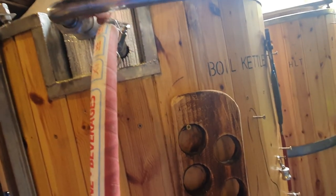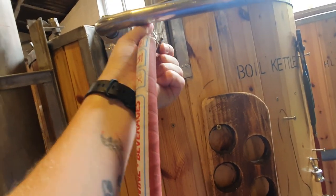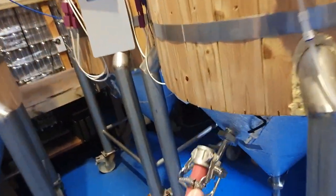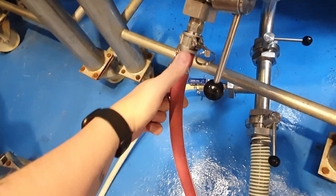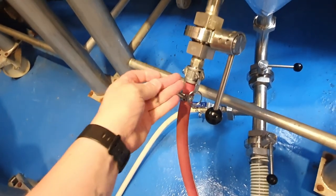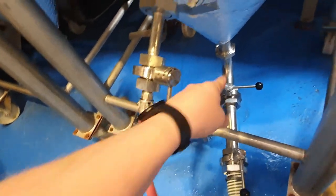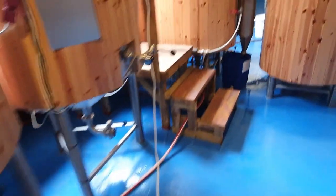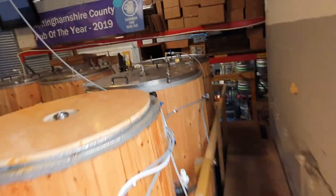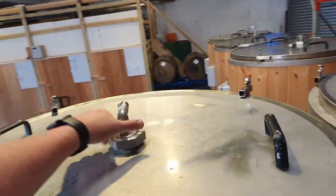Let's come over here and continue with the brew day. I'm going to isolate this supply. Make sure the supply feed in this hose is also isolated — we don't want any accidents as this is still at 80 degrees C and will burn. So we've disconnected the pipe and we're going to bring this brewery hose across here and hook it up straight to our valve on the front of the tank.